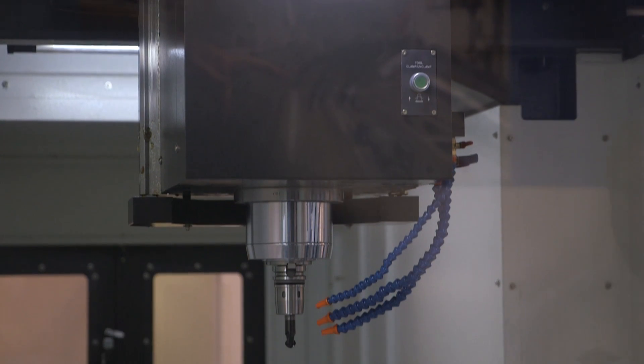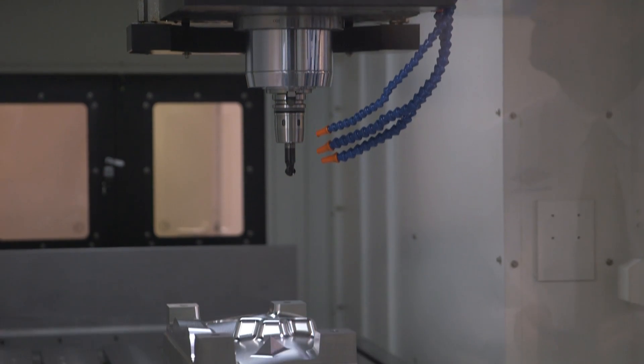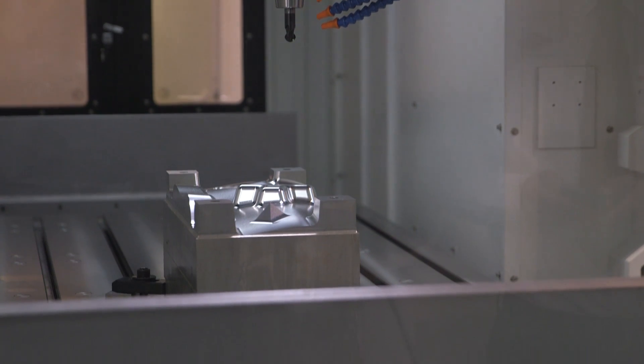In terms of spindle options, is this manufactured by yourselves? Yeah, KFU have their own in-house spindle manufacturer, which is good in itself. We have full control over the quality of the spindles, and to be fair, we have zero issues with them. These machines produce a lot of swarf — we've got twin augers on this machine, and we can put full swarf management in as well.